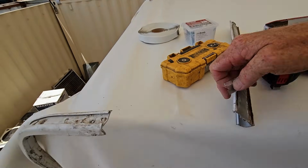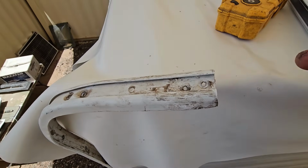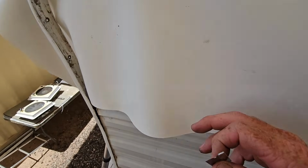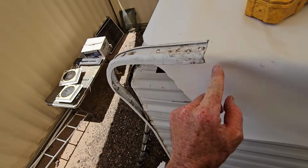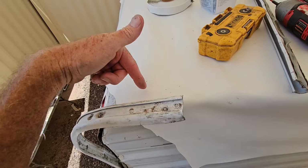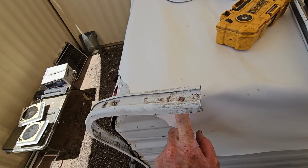Now before I can put this molding on, I do have to put the rear molding on. And I do want to try to save as much of this rubber, as much of this membrane underneath this molding as I can too, because again, it'll be just like having the membrane tape underneath this molding like most manufacturers do now. So I will cut out the excess because the seam is right about there. So with that out of the way, now I can put putty tape on the molding here, screw it down, and then once this is screwed down, and this molding's down, I can cut all the extra membrane off right there. But we'll have some more water intrusion protection even underneath this using this also.